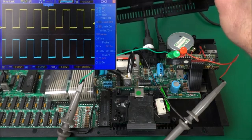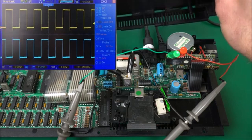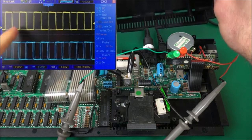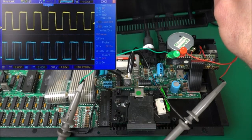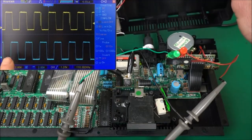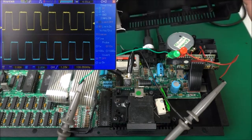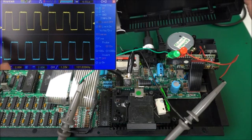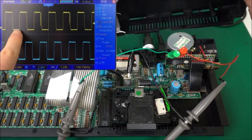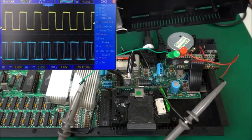So we're writing just like before. It's interesting that we don't see them offset. I expect them. And there you go. So when we read back, we have that square wave in both of them. Let me do a capture. I guess they're slightly offset, not completely, which is probably what I would expect because it's almost writing in parallel. So that makes sense. By the time it's done with this one, it starts with that one. So that's what a healthy one is supposed to look like.